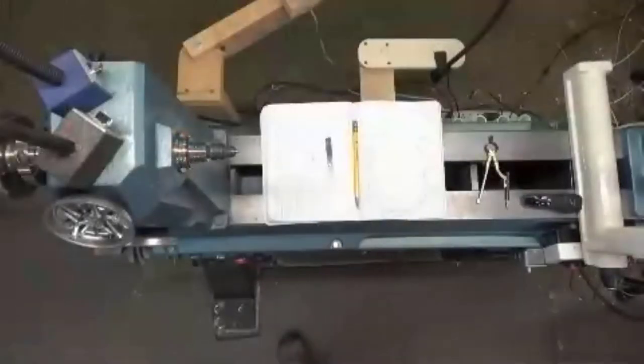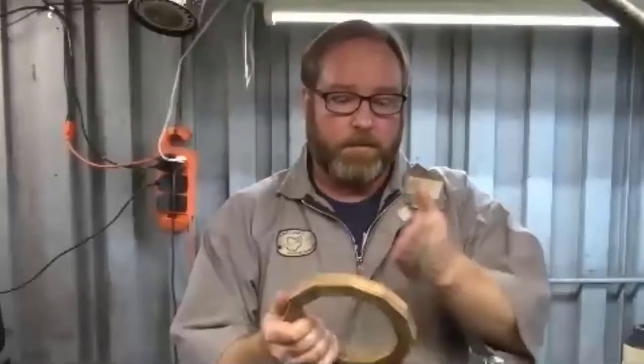And every ring is going to be different. A bigger ring obviously is going to need a little bit longer piece. For something like this, say it's 1 1/8 inch length. So 1 1/8 inch times 12, plus 12/8 between each for the cut, plus another 4 inches. So you're probably going to end up with something around 24 to 28 inches board length. And again, that's for a ring of this size. If you're doing a bowl or a platter and you've got a much wider ring, you could end up with a 6 foot long board just to make one ring.